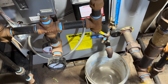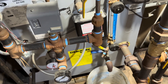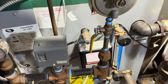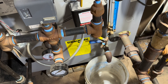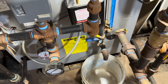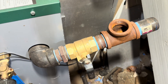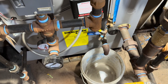The answer, I think, to how to make your boiler last forever is to bump up the pH and only add water that's either been heated up to drive out the oxygen, or add distilled water. This thing is never going to rot out. How many years could it last? Who can even tell — I'm going to be dead. Just on principle, I'm only going to be adding water here from now on, and it's going to be water that doesn't have oxygen in it. That's the end of the video. Thank you.